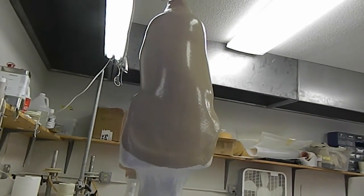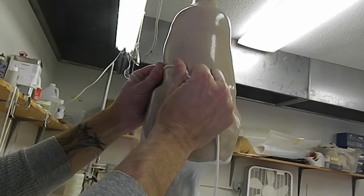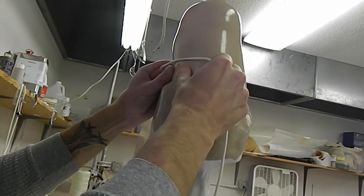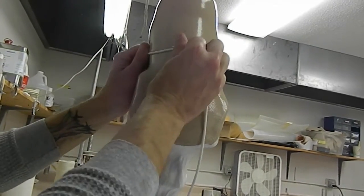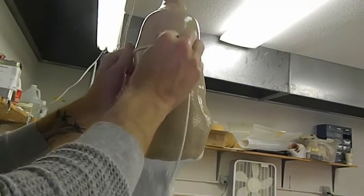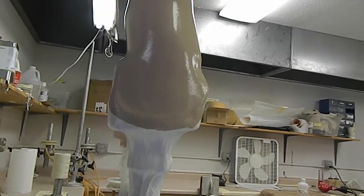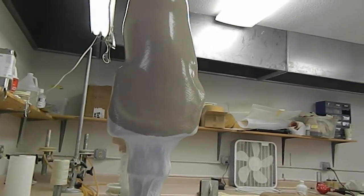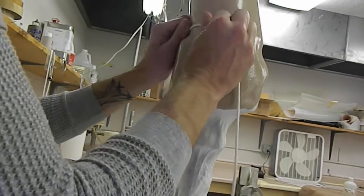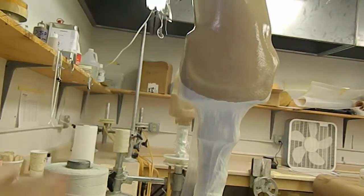So that tells me one of two things: either I've got a hole in my bag. Usually if you've got a hole in your bag that's sizeable enough, you can pull the resin down and it'll actually come out of the hole. It can be a pinhole that the resin just won't come out of, but it's still enough to suck air in. It can be in the inner bag or in the outer bag. I'll give it just another minute to see — sometimes you can just... yeah, it's coming back.